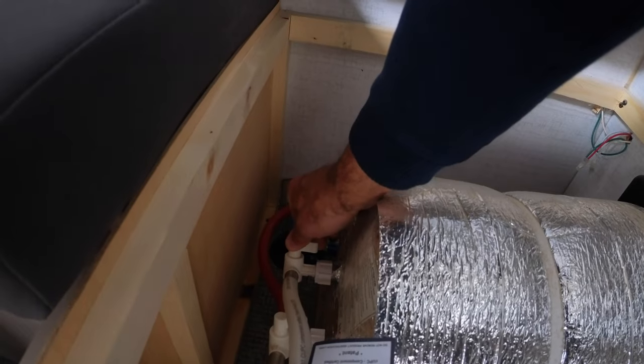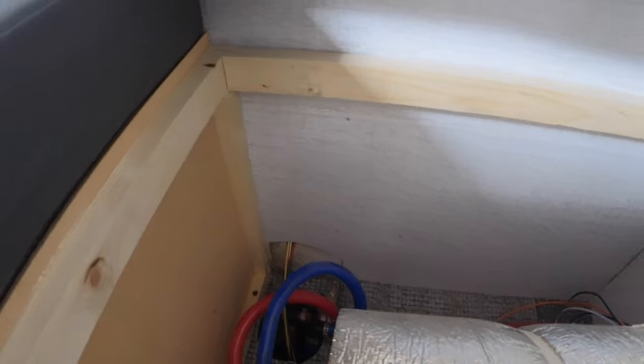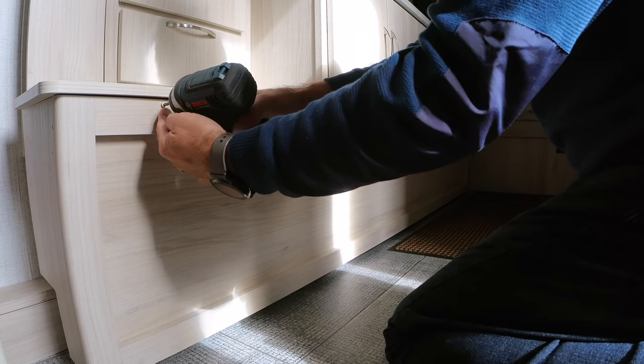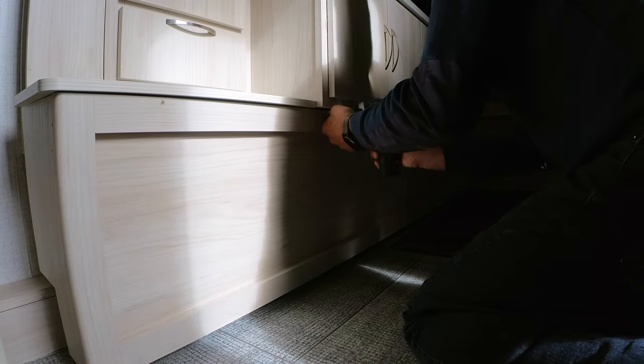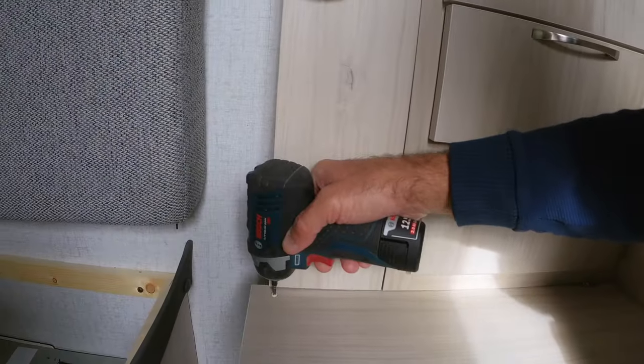At this point you want to turn on your bypass valves so you don't get any antifreeze in your hot water tank. Right here in the corner on this particular unit there are two low drain points that we want to open — they might not be the most visible for you guys, it's kind of in a corner. Now all that water is going to drain out of the system. While the low points are draining, we can remove the bolts holding the cover. Make sure not to lose your screws — there are two bolts on each corner.